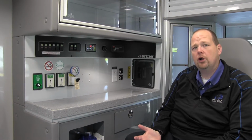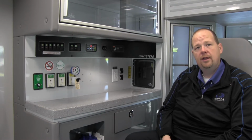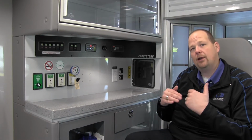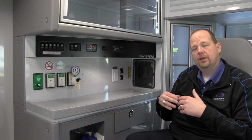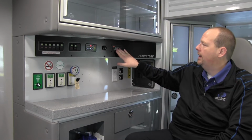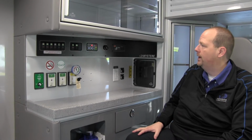First would be bulk charge, which means your batteries are lower and it's giving them a rapid charge. Second would be an absorption mode, ABS, which means the batteries are nearly topped off and the charger will go into a trickle cycle. And the third will be FUL for full, which means your batteries are topped off, you're plugged in the bay, and you're ready to go.